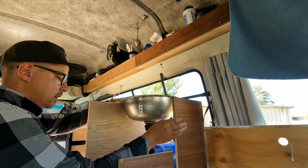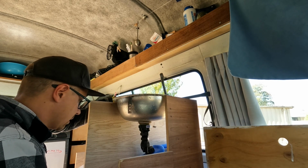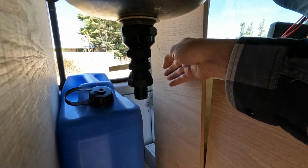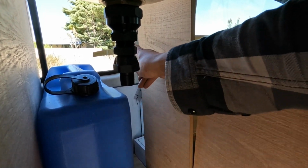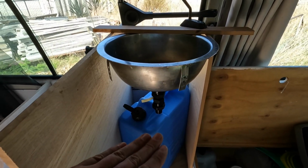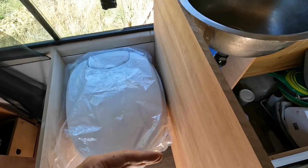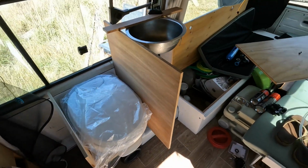If we do that, we can go much lower to, I reckon, 90 again. That was pretty good height. We're gonna have the trap here to the back, and the T-junction with the vent will go this way. So this is what it looks like right now. I want to go a little bit lower, and this sheet is gonna be 51 until here, because this just feels way too far into the room.